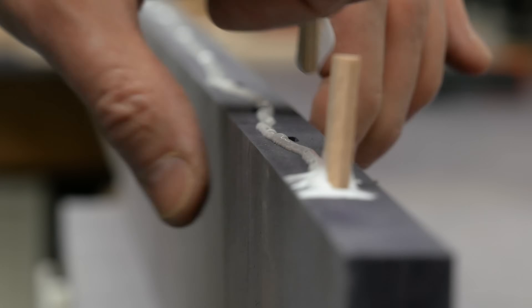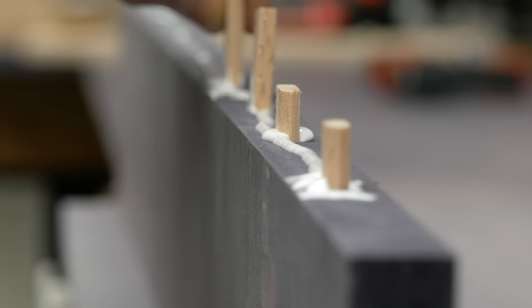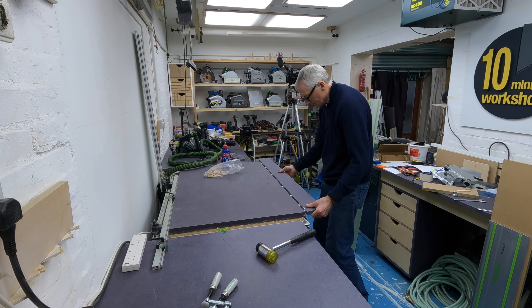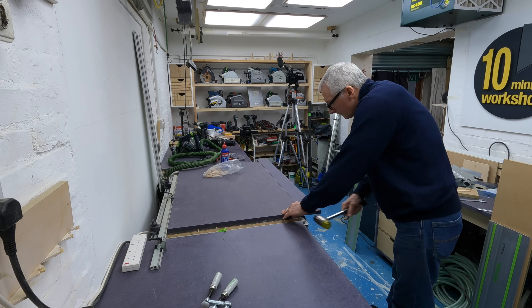When it came to make my bench top I realised I'd had the Fibro Colour cut to 700mm, not 800mm, and I didn't much fancy buying a whole sheet just to get a bigger top. So I added a 100mm strip along one edge with loose tenons and glue, clamped it overnight, and it's as solid as anything. An off-the-shelf MFT3 top is about 80mm smaller than this bench, so adding an 80mm strip to a commodity top would be a thrifty way to do it on a budget build.